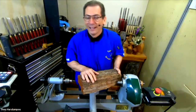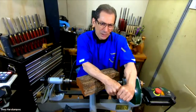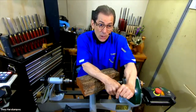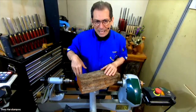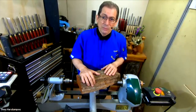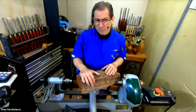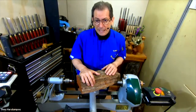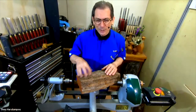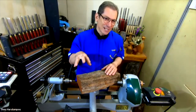One more thing to cover: somebody pointed out that a lot of fence posts are treated. Back in the day they used creosote, and some used CCA — copper chrome arsenate — which is the last thing you want. Usually it's only the part that goes into the ground that's coated. They also used to dip them in old motor oil before putting them in. But with cypress pine they didn't need anything because the whole idea of dipping was to stop termites eating the timber.